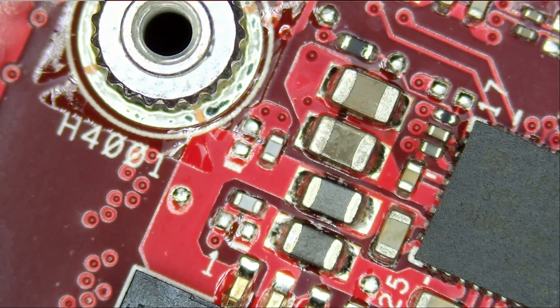If I have to take an educated guess, I would say it's the cap on the bottom — this cap right here. If I want to be 100% sure, we can use our atomizer. Let's go ahead and use it. I'm going to apply some rosin flux over those caps, inject voltage, and then we'll see where the rosin melts first.